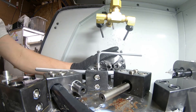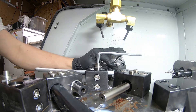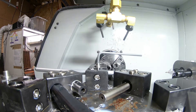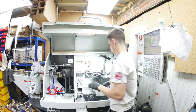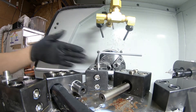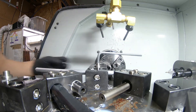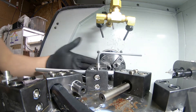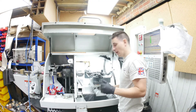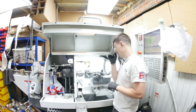What I've decided to do is take the chuck that we've got, fit the 8mm end mill in that and use an adjustable height tool holder that we've got for the OD turning tool. Luckily the rods basically fit perfectly in these blocks and I can set up a repeatable job where we can actually then mill by using the chuck. Hopefully we can get around the issue for now because it's going to be about two weeks before anyone can come and actually fix the live axis.